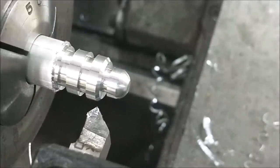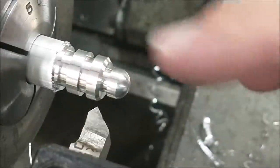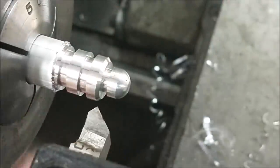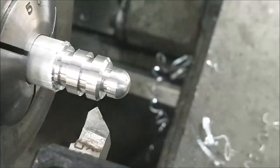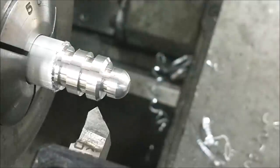855. I'm going to do this exact same procedure for the backside chamfer. I want to chamfer it before it falls off just because the tool's in, everything is hot and concentric. And let's do it. Now remember that the backside has an additional 5. So once you make contact, you'll have to go 30 plus in order to allow for the material you left on the back of this part.